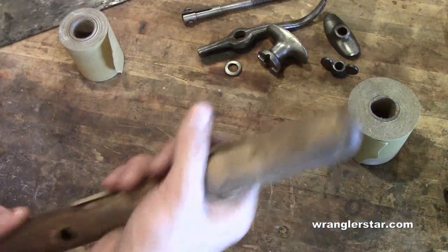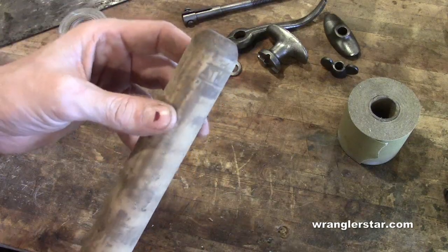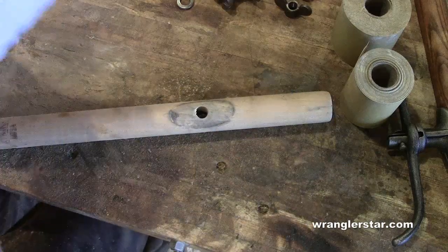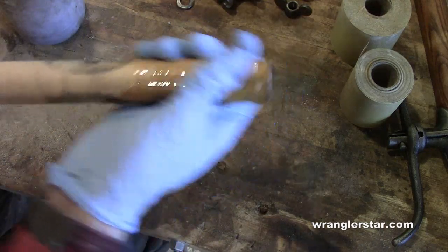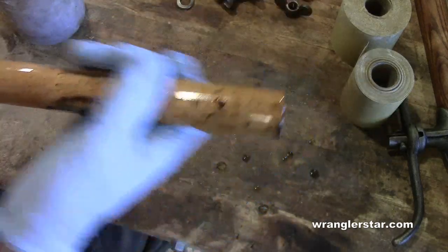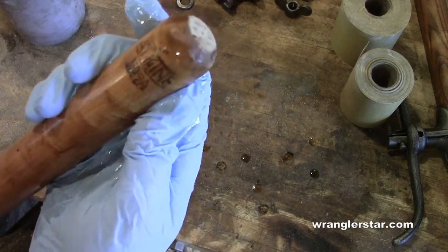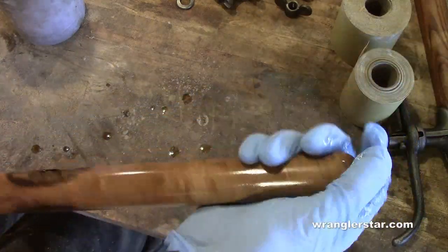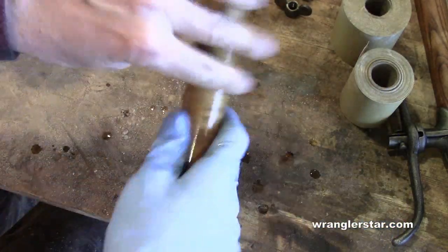We'll start with a 180 and clean up this vintage handle, then treat it. Always a surprise — Atkins, number 24. An original Atkins handle. With the original handle finished off with 320, we'll use the ubiquitous boiled linseed oil — the best treatment for wood tool handles. You can still see the original lathe tool marks in there. There's a nice vintage look to it — it's rare to get these old handles like this, and I've been so lucky to have so many come through my hands.